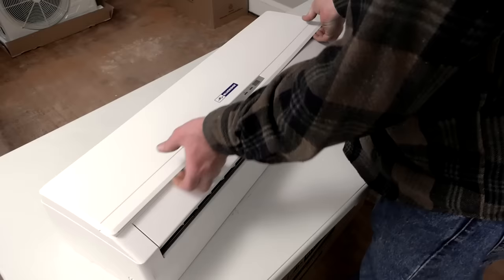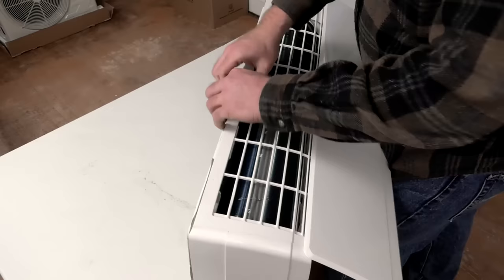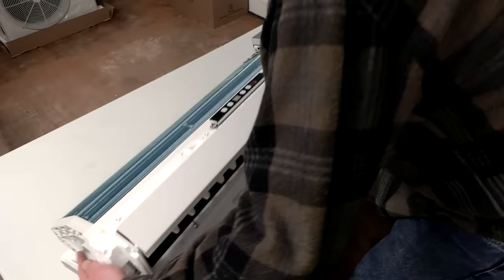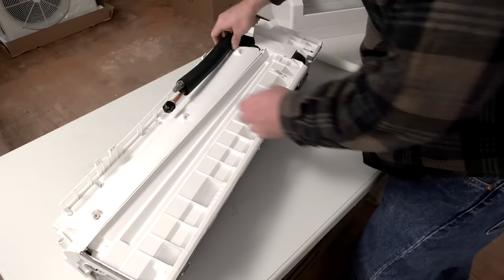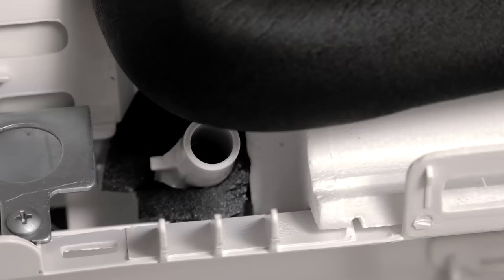This requires removing the outer cover of the air handler. Open the service hatch and remove the four screws across the front and the fifth screw in the center bottom. Turn the unit over and release the four locking tabs. Carefully lift off the cover and turn the unit over to expose the drain connection. Unfasten the retaining clip for the drain hose and remove the drain hose. Next, locate the rubber drain plug on the right side, remove it, and use it to plug the left side drain. Replace the hose on the right side drain and fasten the retaining clip.